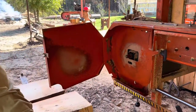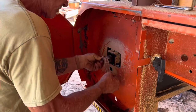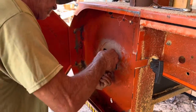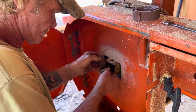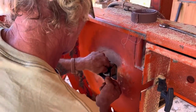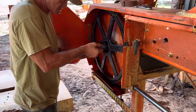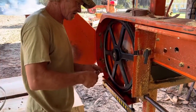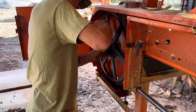I'm going to go put that one back on Bradley's mill over there. I'll get the emery cloth and we'll clean that up. Get some regular emery cloth, clean it up a little bit — makes it a lot easier to slide back on, takes all the burrs off. It slid right on there, guys. I ain't done had it on before I could get the camera up. Put it on there just like it was supposed to after polishing that shaft a little. Tighten that little screw on the outside — that's half inch. Tighten it up, put the belts on, we'll be rolling again.